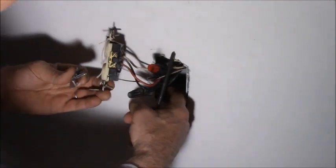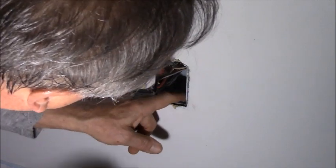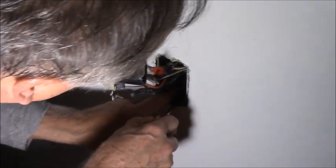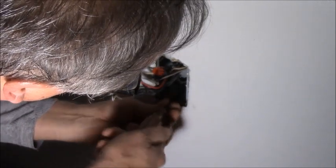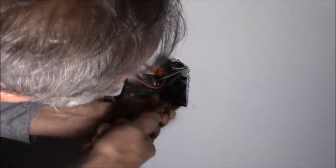And back in the day, they used to allow you to run circuits that were in opposing phases with one common neutral. And we did that a lot. It saved money. The three-conductor wire cost a little less, and you could run two circuits with one wire. You know, we were contractors. We're in the business to make money. So yes, it's the right size screw, thank goodness. Standardization, I guess.